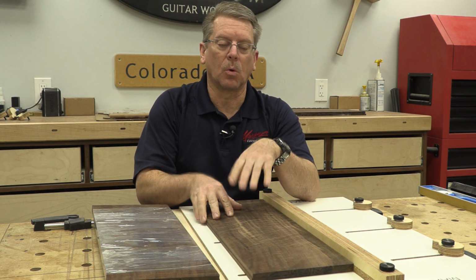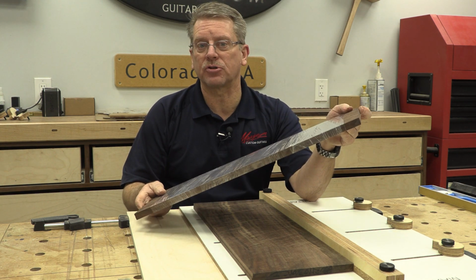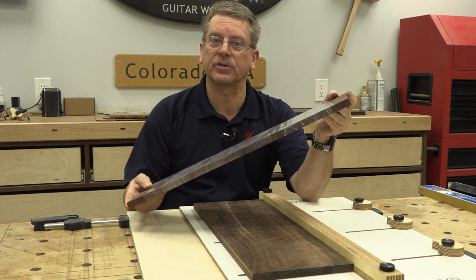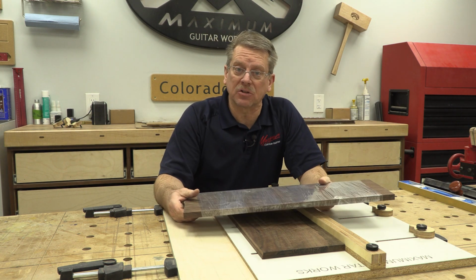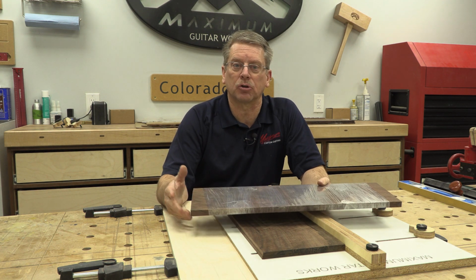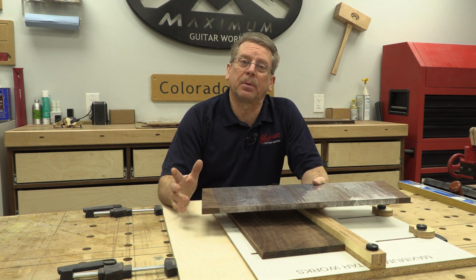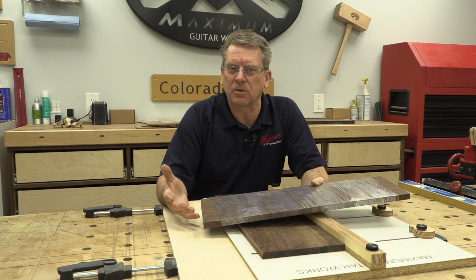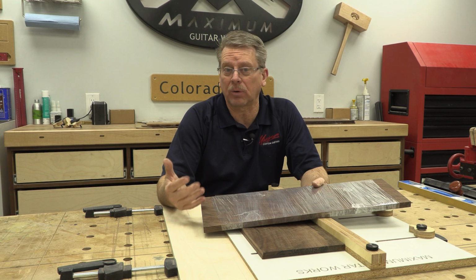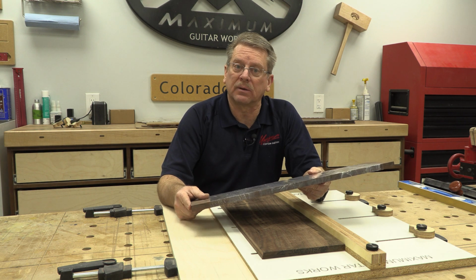However, when I ship them, I bring them back together and ship them tight so that as temperature and humidity change while they're traveling through different areas, the boards will continue to stabilize themselves. So what I recommend is, if your area is much different from my area, which is an average of 20% humidity, and I keep them in a climate controlled area of approximately 65, 70 degrees, then I would plan to let them stabilize, or acclimate is a better word, to your area and give it as much time as you can, really. If you can give it 3-4 weeks, I think that would be an ideal situation. So leave it wrapped during that time period.